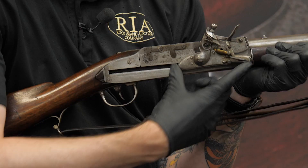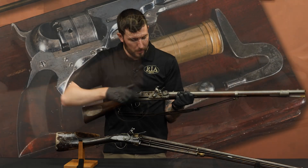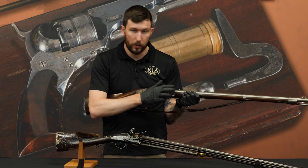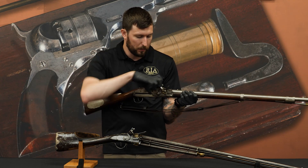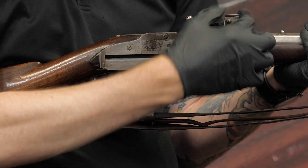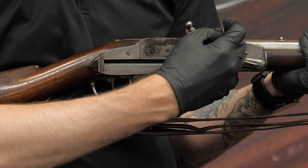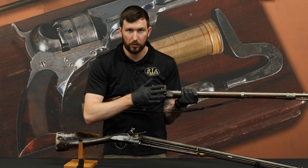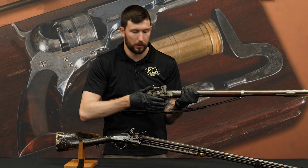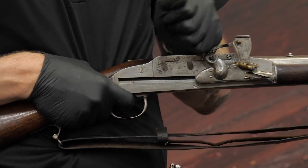The idea is basically a rifle that allows four shots without reloading. It's got a pistol-sized lock mounted in a sliding steel bracket. Right now the lock is in the front position for the first shot, with the pan open and unprimed. When you pull the cock backwards, this powder magazine primes the flash pan, and this little screw hits the back of the frizzen and knocks it closed — very simple, not terribly complicated in that regard, but very durable compared to some other automatic priming designs.